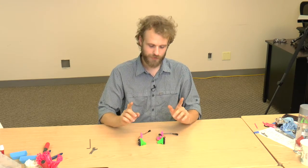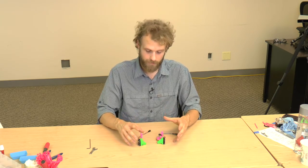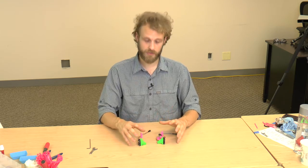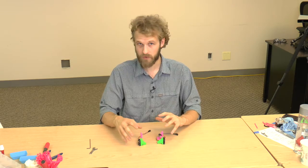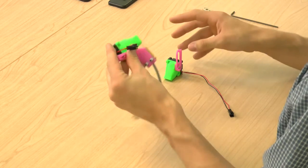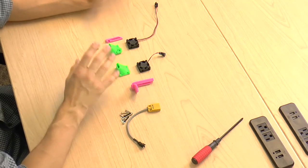On the JellyBox, we're using two fans to cool the filament right as it's exiting the nozzle. It results in better quality prints. We're going to prepare these two by putting together the filament fan shroud, the filament fan mount, and the fans themselves. On the right side, we're also going to attach the proximity sensor. Let's start with the left fan.